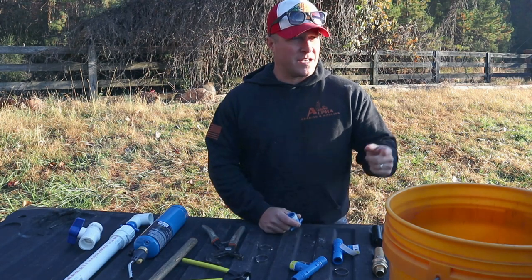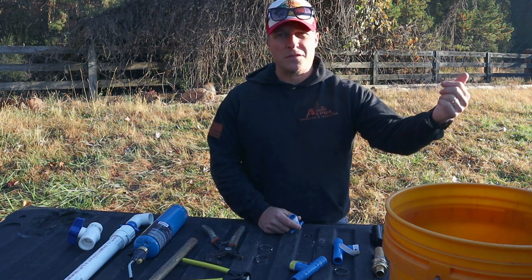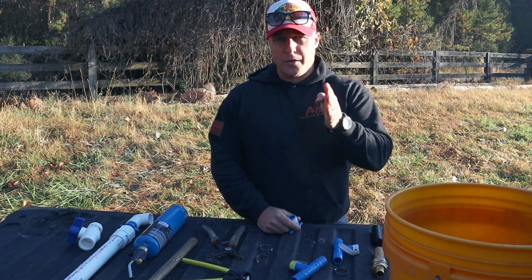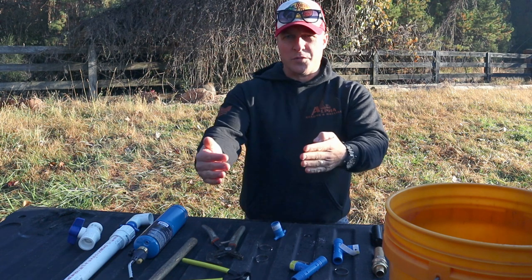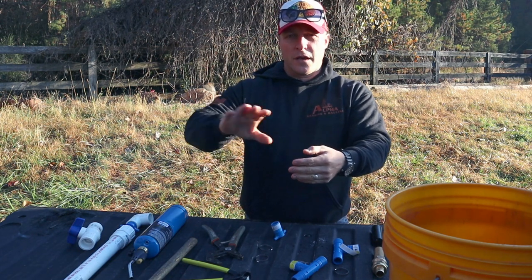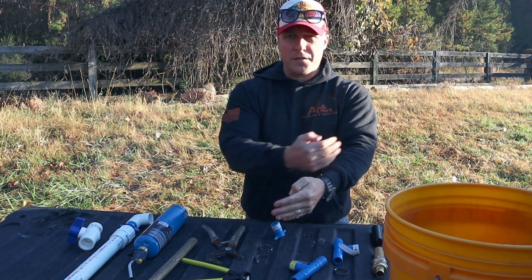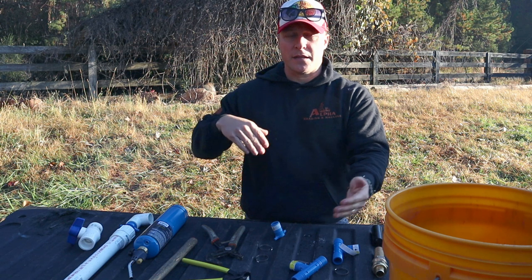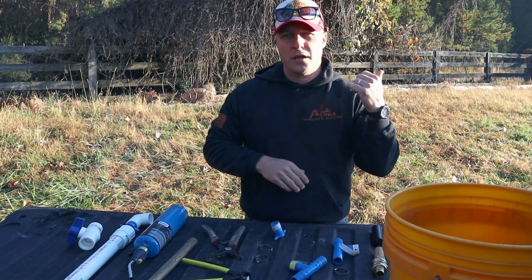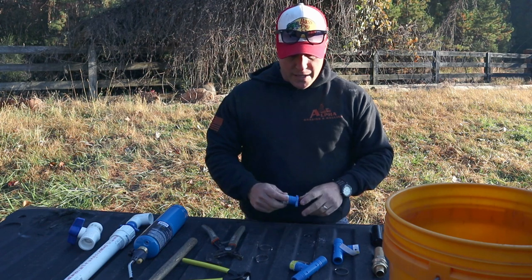Today we are going to get the power lines run back from the house to the well house. So we buried our main power going from our power pole to our house, and because we only want 1 meter on the whole property, we have to back feed our well house back up through the same trench, and then that way our well house will get power again down the road when we get rid of our temporary power pole. So we're going to run those wires today.